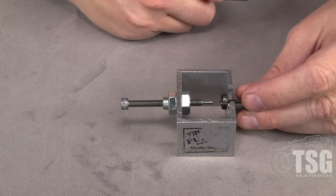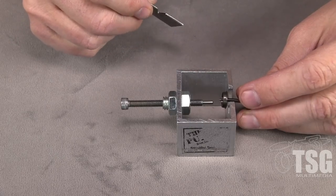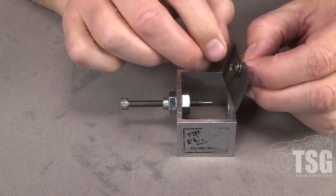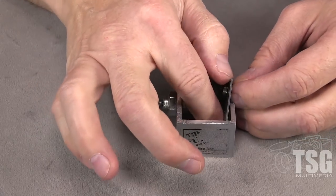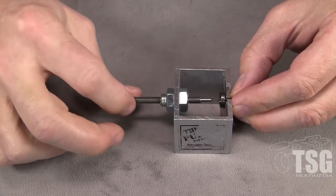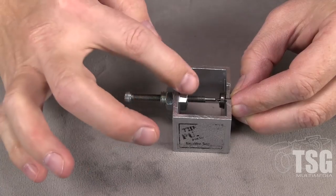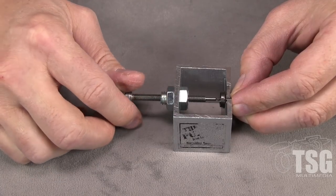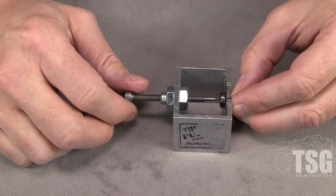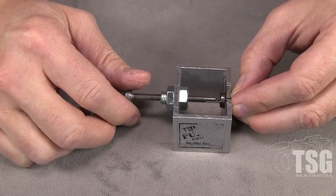So this is a wheel puller or gear puller. Yep. And this is useful for re-gauging wheels or installing or removing gears for motor shafts. Yes, I've seen you do both of the above. It has this little plate for stuff that's smaller than this big opening here. You just put a wheel in there and then turn this crank until it's against the axle, and then keep turning it and it'll force the wheel to move. Or force the axle to move, right? Force the axle to move, yeah. So if this wheel set was out of gauge, this would be one way to put it back in gauge.